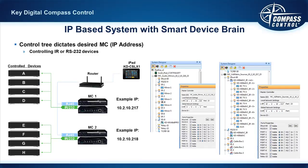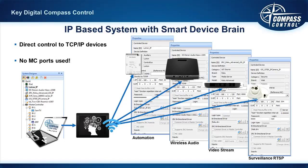This is all possible because you do your programming in Compass Navigator and build what's called a control tree. That control tree tells the system which devices are connected to which master controller. If you want to control devices A through D, the iPad knows — because the programming is loaded into it — that it needs to talk to master controller one at 10.2.10.217. It's quite brilliant and very fast as a result.